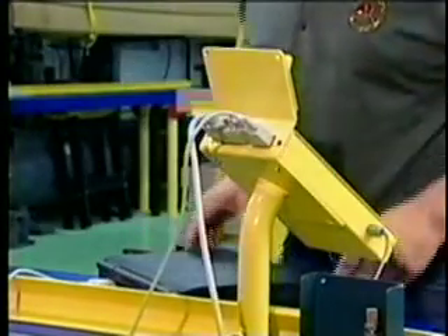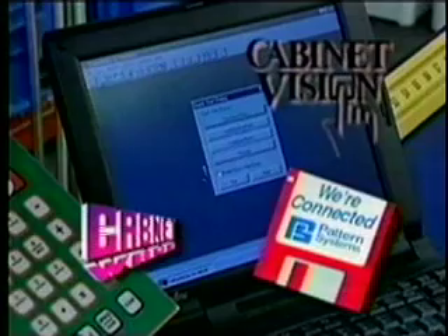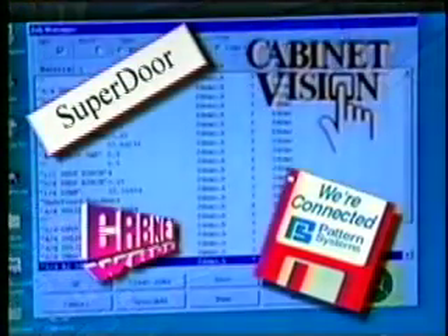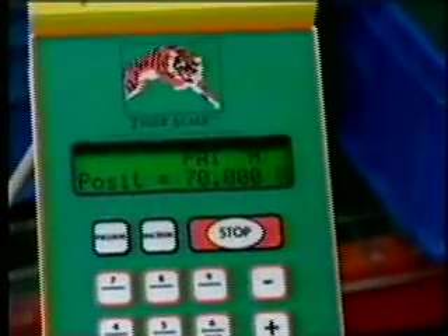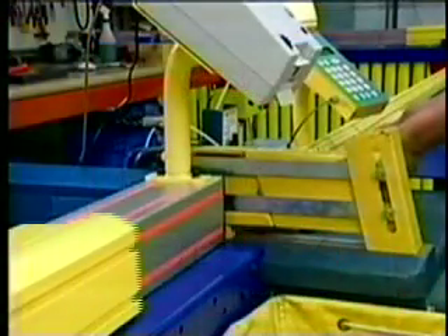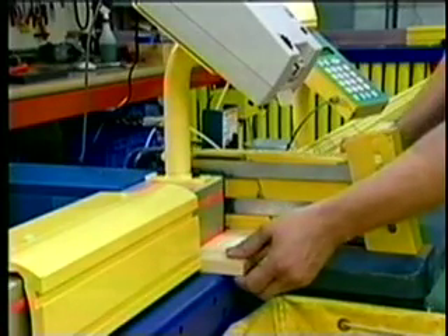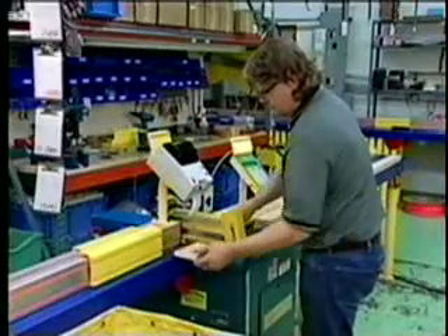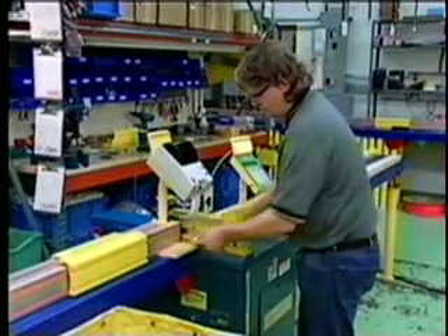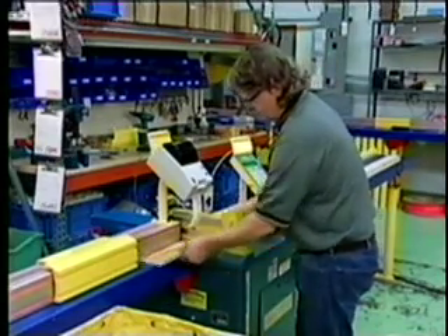Do you use a software program in your shop? Cut lists can easily be downloaded from almost all common design programs like CabinetWare, Cabinet Vision, and Pattern Systems, and other Windows 95-based or newer software packages including Excel. Once you've programmed the TigerStop, you're free from settings, checking your counts, and dimensioning. The optimizer software designed for the TigerStop makes the most of any piece of material, matching your cut list to the clear length and saving you labor, money, and material in one step.